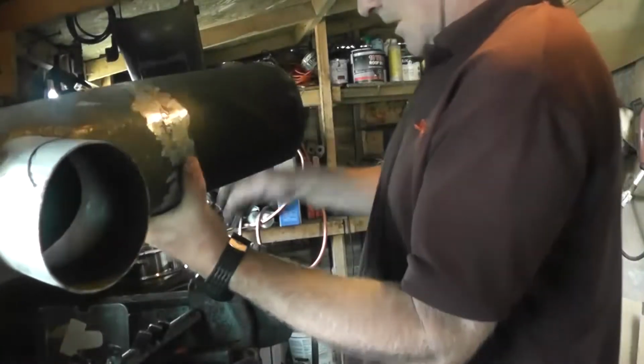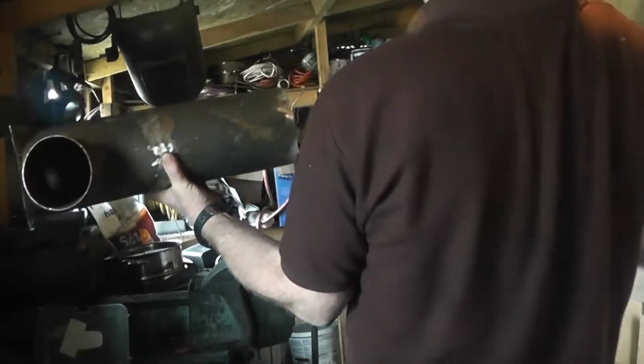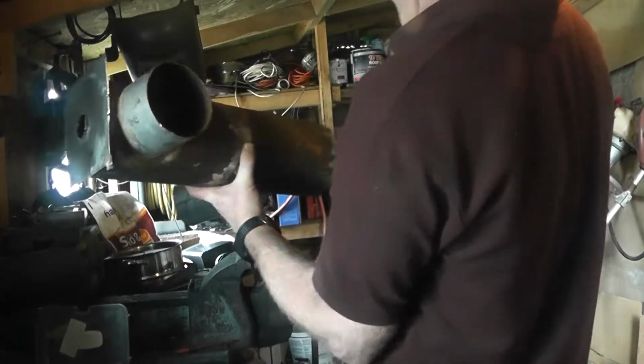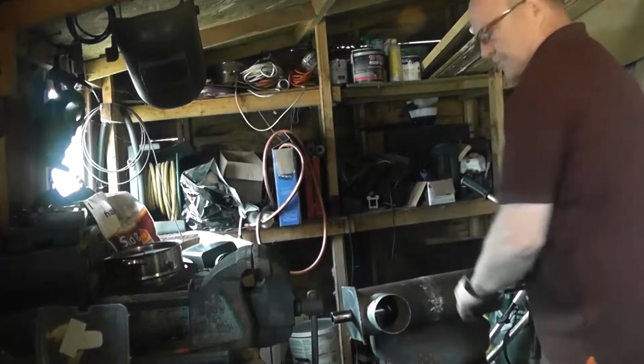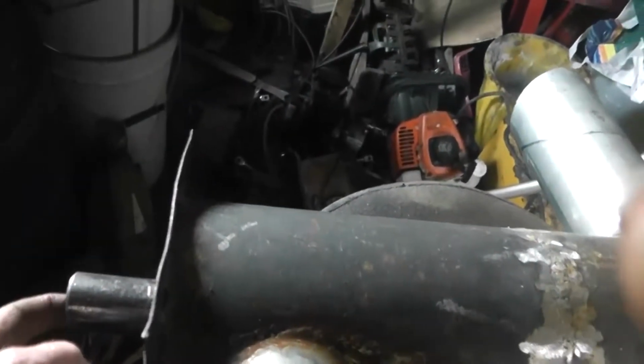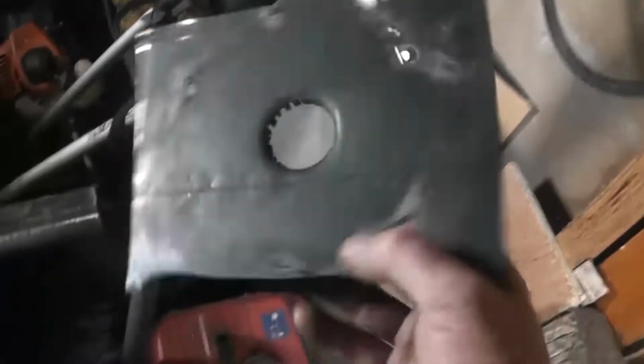Basically, how we do it, a quick idea is this guy goes in here. You see that? Yeah, so I'll put it over here. So yeah, here's my idea. The hot air from the Chinese diesel heater goes in here, the exhaust pipe goes in here, the exhaust goes through this pipe, which has all the fins on it, all these guys. So it's sealed at both ends of the end plate here. Still working on it. You can see how I'm tacking it all together, but it's sealed at both ends.